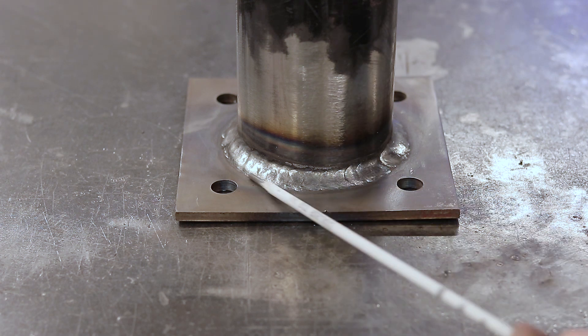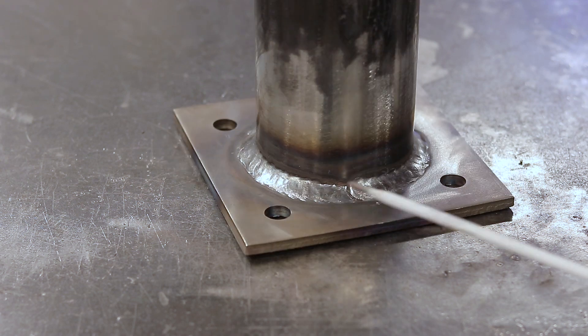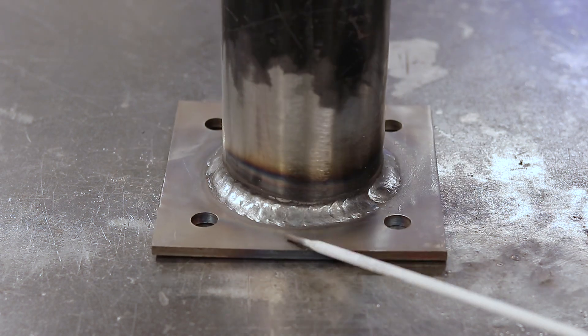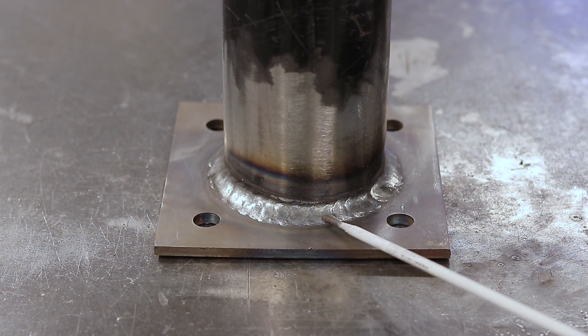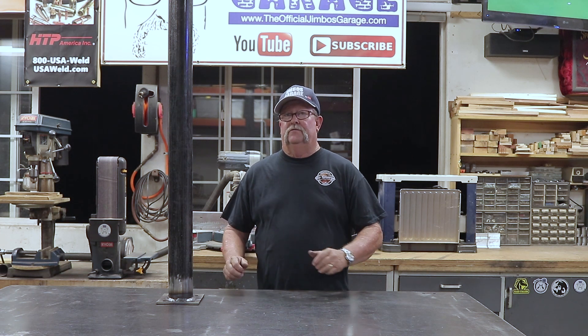Well, there it is. Turned out really clean, really good — good tie-in all the way around. That's the beauty of dual shielded flux core: get your settings just right and everything is dialed in. All I've done is taken a slag hammer, chipped the slag off, hit it with a wire brush, and wiped everything down with a rag. It's virtually spatter-free — zero spatter all the way around. The column project is complete. The dual shield flux core really excelled here. I adjusted the CFH to about 45, brought the wire feed speed down to about 480 inches a minute, and I'm running 26 volts. Get the right combination and there's nothing like it — it's smooth, clean, and fast. It's a great process.